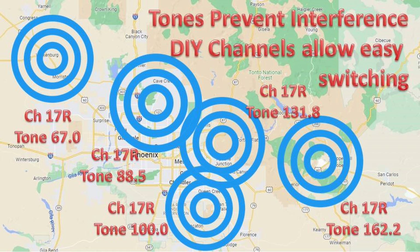These systems are used to prevent users from triggering more than one repeater simultaneously. With older and more basic GMRS radios, you'll need to enter the radio's menu system and set the proper tones on the repeater channel you plan to use. In areas with lots of GMRS activity, this becomes inconvenient when there may be two or more repeaters on the same repeater channel that you'd like to use.